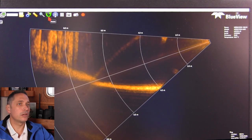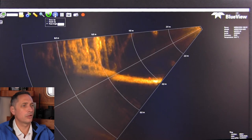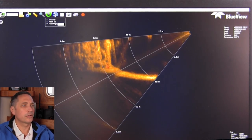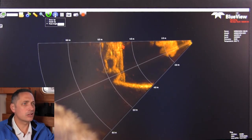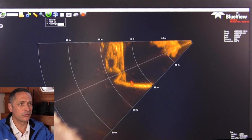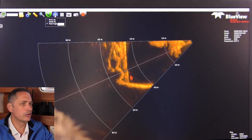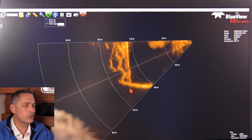I'm just going to set the sonar so it looks a little more upright. The seabed looks flat — this area is pretty flat. When doing an inspection like this, you can see the piling is straight and goes all the way to the bottom. Of course, you'll have some silting near the bottom edge of a vertical structure. Generally speaking, we can see this piling is in pretty good condition.